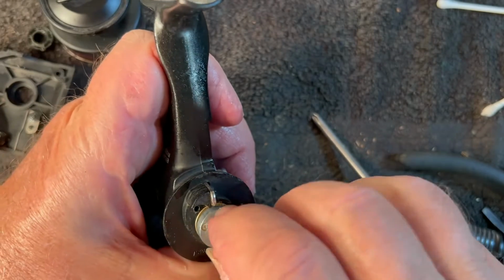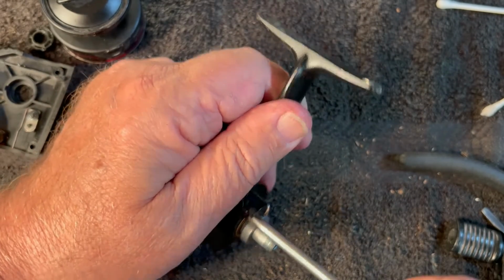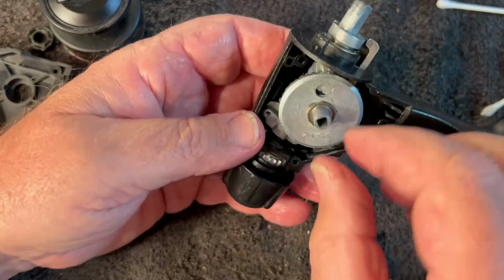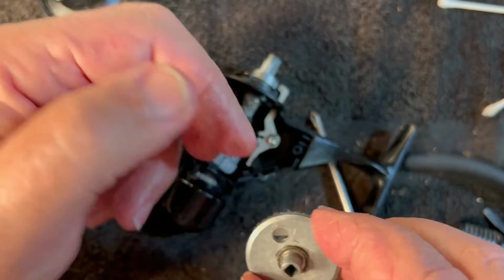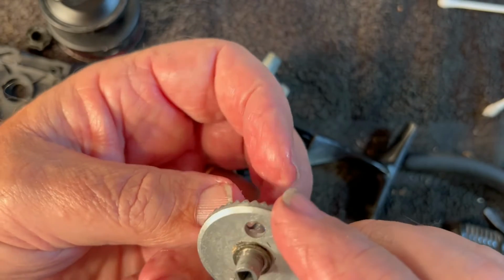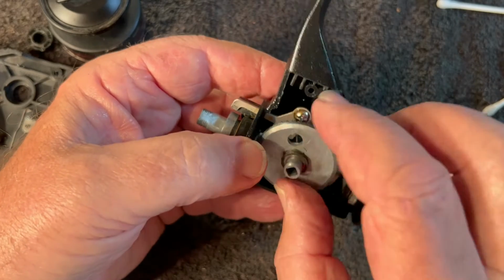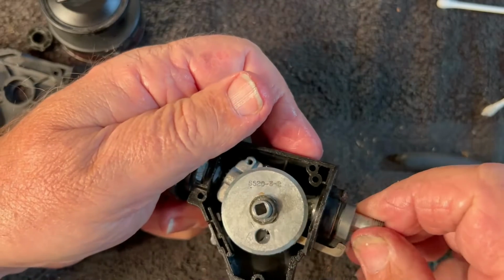Turn it over. Let's adjust the camera around again to get it out of the way. All right, now if we activate the anti-reverse switch, we are no longer working because apparently I allowed this to come out and the wire is no longer in the hole. Okay, so let's clear the grease out of the hole. Let's set the wire back into the hole, right in dead center. And let's set it back in so that wire goes down in that slot. And it is. Okay, we rotate this now.